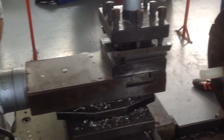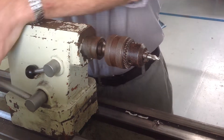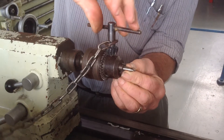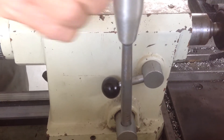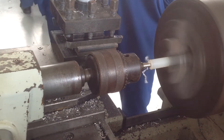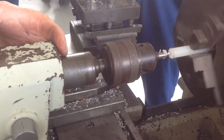Look where it is. We bring the tail stock up. We've got the chuck in it, and in the chuck you have the centre bit. This is the centre piece, which cuts the first little hole. So we put that in there, bring that up here. We lock up the tail stock. We start the hole — run that down. Because it's large, it's very thick. The little hole cuts the hole straight to the middle. This is what we call cutting the centre.